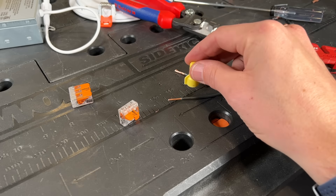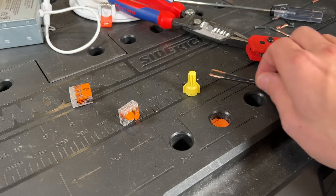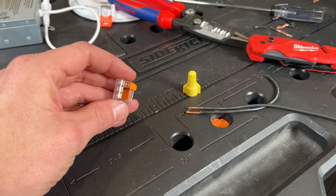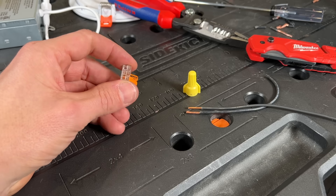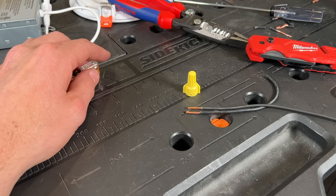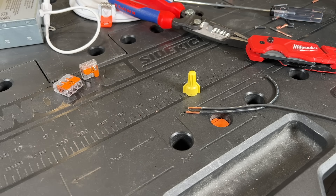So now you know: if you're installing that ceiling light or vanity light and just want to use the standard wire nuts in the package, no problem — now you know how to safely connect stranded to solid. But if you have a few projects ahead of you, I do recommend getting yourself some WAGO 221s. There are sample kits that have two, three, and five pins — you'll see that down in the description, and I think it's a great starter kit for DIYers to see if you prefer these connectors. If you want to see other best practices and things to avoid when swapping out outlets, check out that video — I'll walk you through three issues I found in a newly built home in my area. Thanks for joining us and we'll catch you on the next one. Take care.